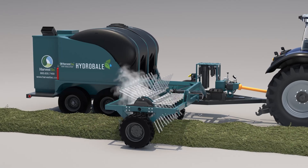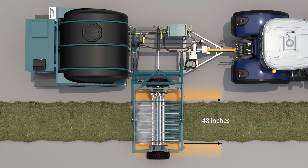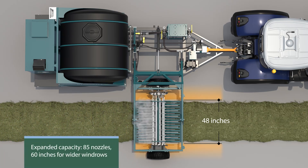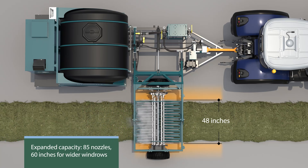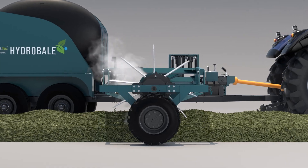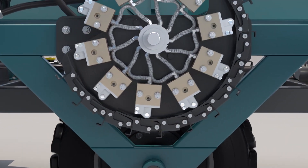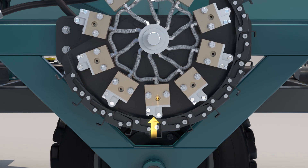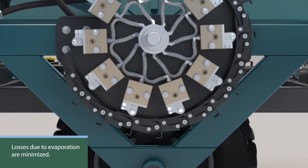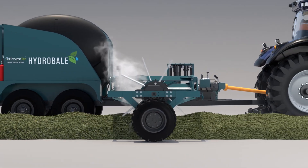The standard reel contains 65 tines and nozzles with an effective operating width of 48 inches. Capacity is easily expanded by increasing the number of tines and nozzles to up to 85 with an effective operating width of 60 inches for wider windrows. Additionally, mechanically actuated roller valves on each crosstube work in conjunction with the 11 adjustable valve trip sections to only release the heated mist to the nozzles that are actively in the windrow, minimizing losses due to evaporation and delivering the fine mist to the entire profile of the windrow, similar to natural dew.